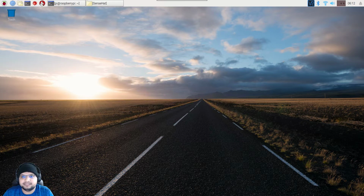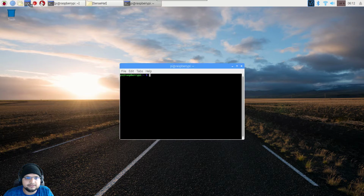So now that we have enabled USB debugging on our phone, all we need to do is to connect the phone to Raspberry Pi. So this is the USB cable. This is the regular micro USB cable in my case, that is connected to Raspberry Pi, and I'm gonna try to install. So let's do sudo apt get install android-tools-adb. Now you notice that I have already installed this, so it will probably not install it again for me.